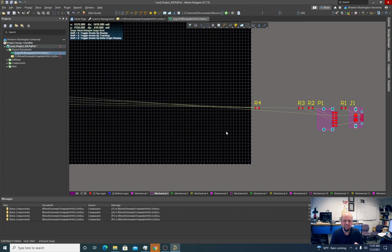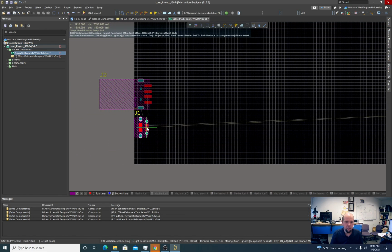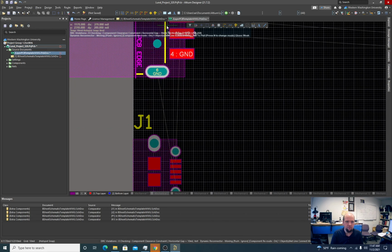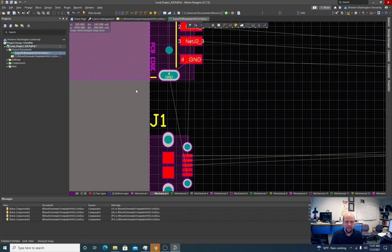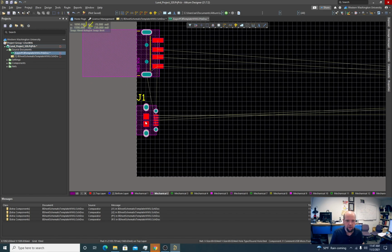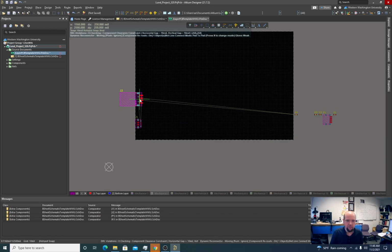Keep in mind that the precision of the edge of the board cut isn't that great. I'm going to put the micro in the middle here. I want to be a little careful because the connectors you plug into these are often kind of thick. This one is USB-A, which goes directly into a computer system. But sometimes the actual physical cable has a really wide connector. I don't know if I have some around here. Yeah, like so, it's a USB mini. Look at that big chunk connected to the little connector, with a huge injection-molded housing around it. That'll bump into stuff on the side. You've probably all faced that. Let's get a little more space.